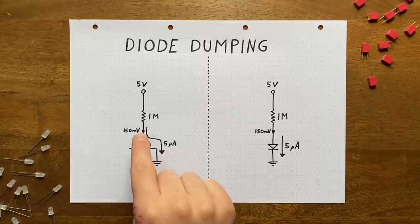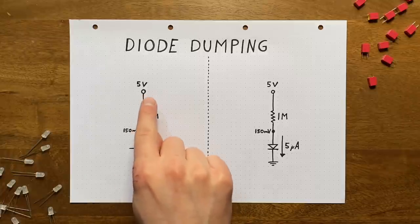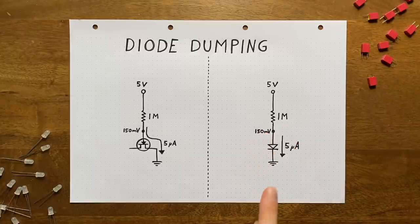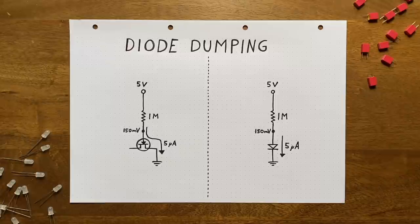Because essentially, the JFET's gate to source path is a simple diode. So as long as the voltage here is zero or below, that diode is blocking. But as soon as we go positive, it will start to conduct. And that conductivity ramps up exponentially as the voltage increases linearly. So simplified, the more we push from here, the quicker and wider the diode will open up, sinking most of the current we managed to squeeze through that ginormous resistor. It's like as if there's a weird little trapdoor here that opens further the more you push against it. Because of this, no substantial voltage can build up above the one at the source. We'll get a couple hundred millivolts, yes, but that's about it.